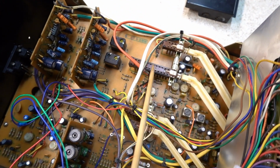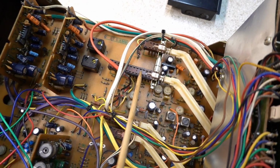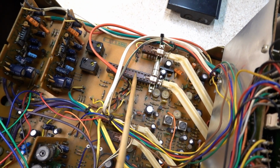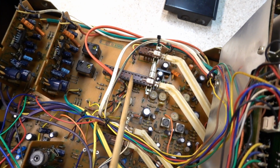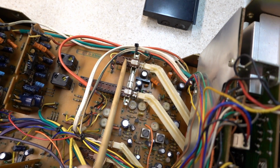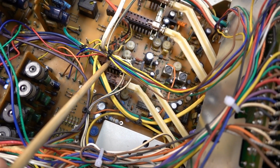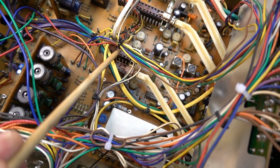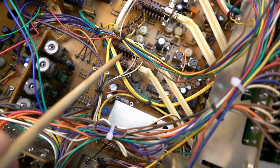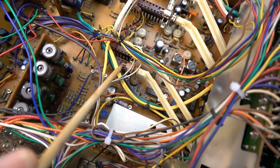What I did do was, as is typical, I always take this apart. This is the Dolby, and I clean and then I DeoxIT the inside of that. This is for the mic. I usually just DeoxIT from the outside. And these are for your source versus tape, and usually because it's harder to take these apart, I just go ahead and DeoxIT from the outside.